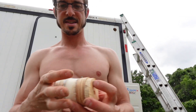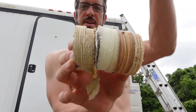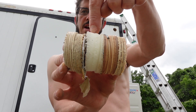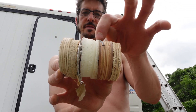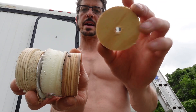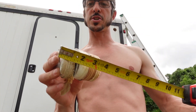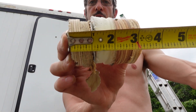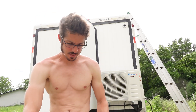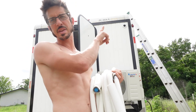Here's the final tally of how thick the door is: the outside siding, OSB underlayment, one-inch polystyrene insulation I installed, the factory roll-up door core, and then a half-inch plywood I installed myself over the factory roll-up door. All together — three and a quarter inches thick for the rear wall. Pretty beefy. Now I'm going to open up the refrigerant line kit. I'm actually going to feed the refrigerant lines from the inside out.